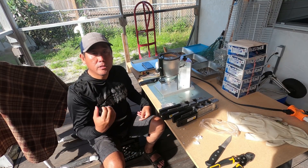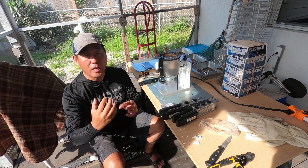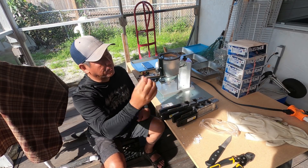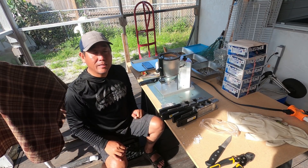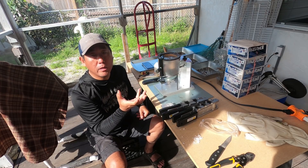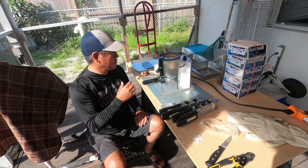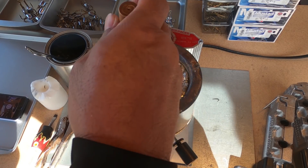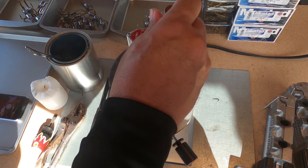The agent I'm going to use is basically just candle wax. There are aftermarket products specifically for fluxing — a lot of people use sawdust or just a piece of paper. We're adding a bonding agent: lead is very dense so it tends to separate most objects, which will rise to the surface. We want to remove that as well as any oxidation. The wax as it burns creates a crust that attracts those contaminants and creates something to bond to them, allowing us to scoop them out easier. I've got some candle wax and I'm going to light it on fire — it's going to start smoking right away but eventually burst into flames.